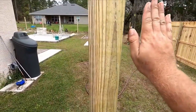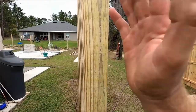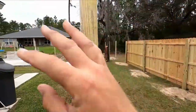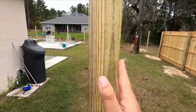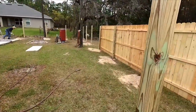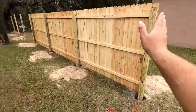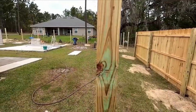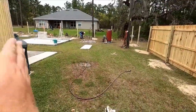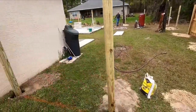And then our door, the hinges will mount on the panel and then it'll swing. Either way, it could swing out or in. It doesn't really matter which way it's going to go, but it'll be flush here because the door will be hanging in the air. And same thing on this side, it's going to be 8 feet from that side to the edge here. So that way the door opening will be from here to here. Ours is 4.5 feet and then two 8-foot sections.